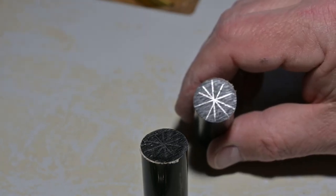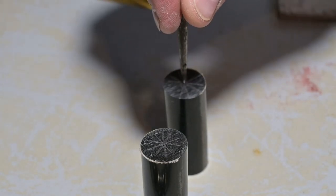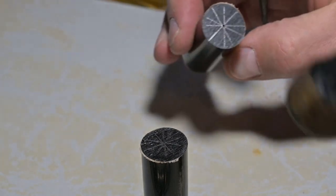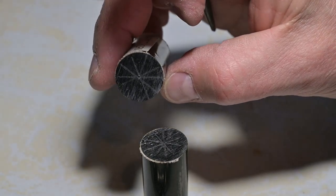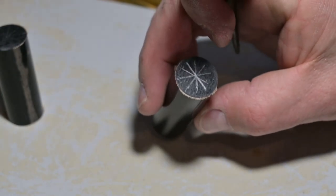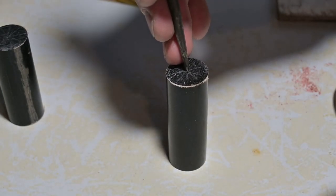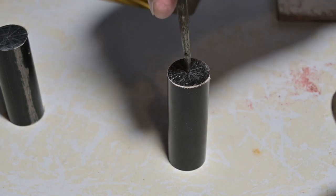Pretty darn center. So I'm just gonna take this and put my awl right there. It looks pretty close to center. Give it a little tap. That's gonna help the point of my drill bit find close to center, so that when I drill, it stays generally in the right spot. This one, I wanna say center is pretty close to right.